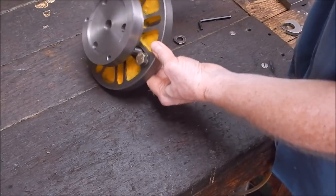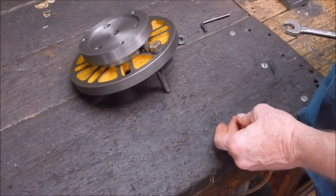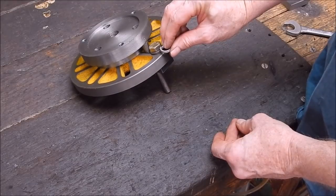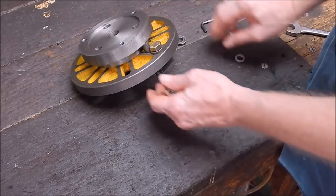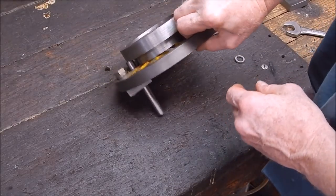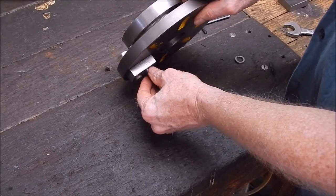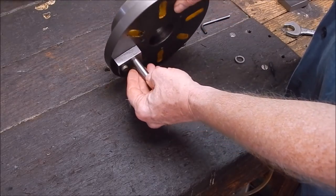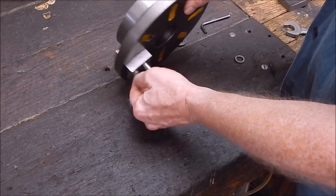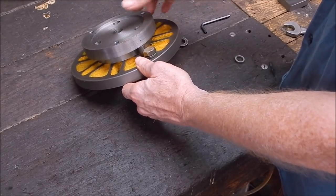And if you've got it there, like that, you could actually put a spring washer under the head as well. And that would stop any chance of it coming undone. So I think that's your best position. You can see it gives you quite a bit of flexibility. You can see in there how the high-speed steel goes, and you can grind and cut that to any shape and length you want. So the whole thing is dirt simple.